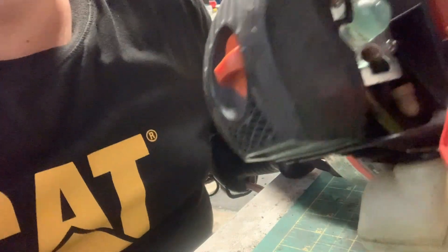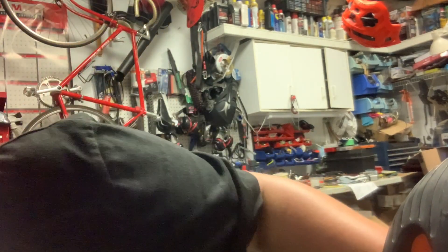If you don't want to buy a new air filter but want your machine running at peak performance, take an air compressor and clean it out. I've even seen people wash it in water and let it dry — supposedly that works. Or it's just a couple bucks to buy a new one on Amazon or at an Echo dealer.